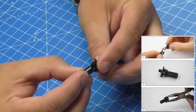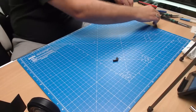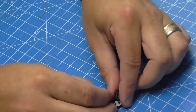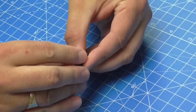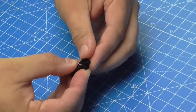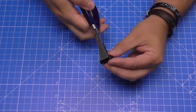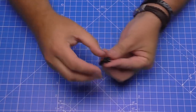The cylinder goes into the brace just like that, but it needs to be held in place with the pin. The pin has one smooth side and one rough side. You put it in with the smooth side and then use tweezers or pliers to push it home so it comes out the other side. I'm going to use my duckbill pliers to push that home, just like that. Easy way to do it — and as you can see, it's now attached perfectly.